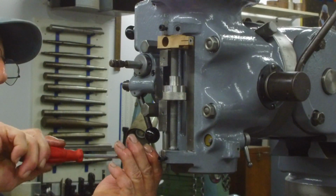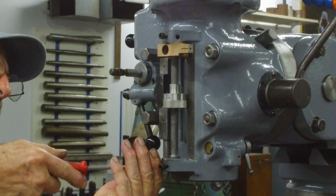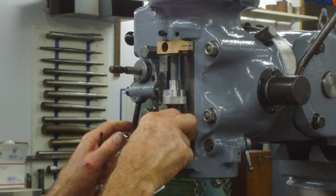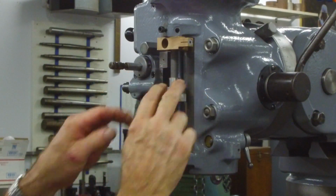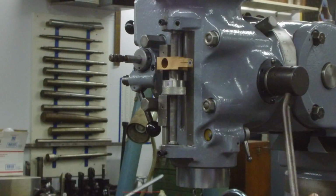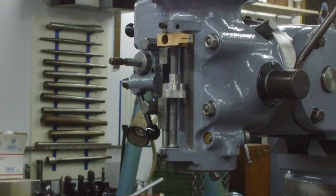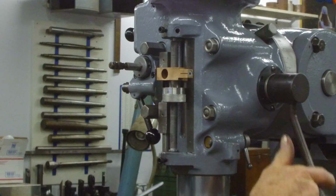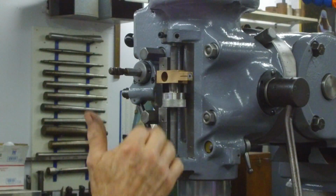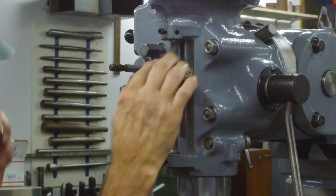Alright, pivot pins in there. Okay, that moves freely. And when that pressure comes down, actually you can see it here. Actually, it has to be feeding down, and then that pressure comes on there and trips it out. Okay, that's in the downward position. Now the trip linkage has an upper trip as well, so if you're feeding up and your quill hits full up position, it's got to trip out as well, and it trips that same linkage by using this dog bone here and a little push pad right here.